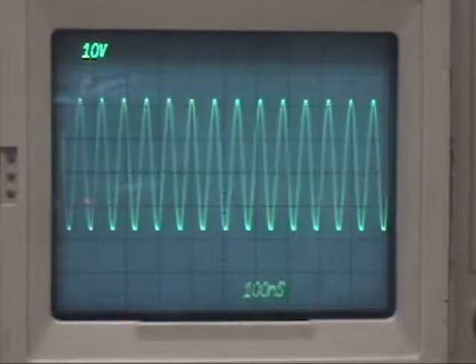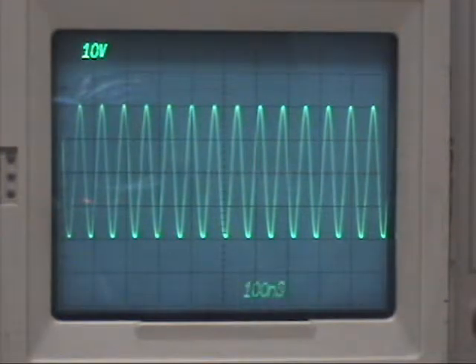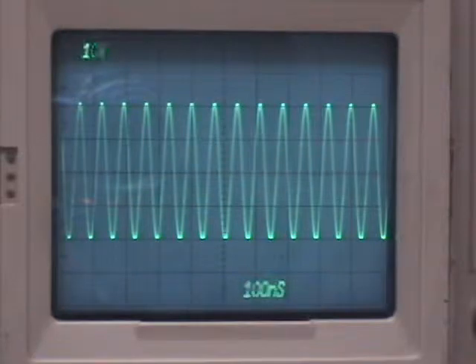The way you measure power: we have 40 volts peak-to-peak. The formula says peak-to-peak voltage divided by two gives you peak; times 0.707 gives you RMS; then you square that, because P equals E-squared over R, divided by the impedance. So here we have 40 volts divided by two gives us 20 volts, times 0.707 gives us 14.14. If we square that and divide by 50 ohms, we end up with 3.98 watts — close enough to four watts. So when you get 40 volts peak-to-peak into 50 ohms, you have four watts there.